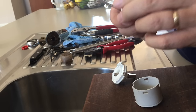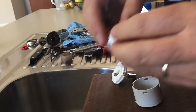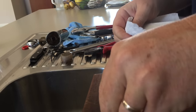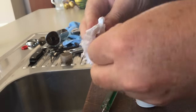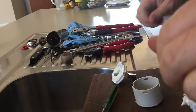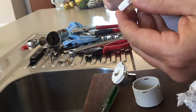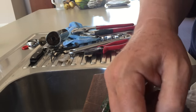There are your rubber O-rings down below — that part doesn't move, it stays sealed into the base. The part that moves is that face there. What I'm going to do is get some paper towel, wipe that clean, and then reapply the silicone-based lubricant onto that face, because if it gets a bit of grit in it. So just give all of that a wipe down. Then I get the silicone-based lubricant and put a good amount on that face — that's what's going to be moving around — and put a bit in there as well.